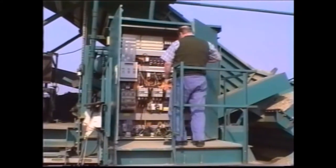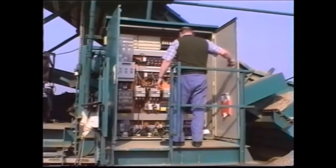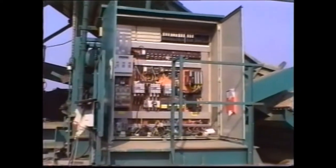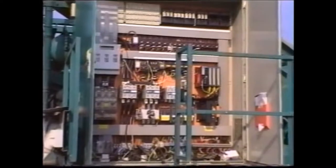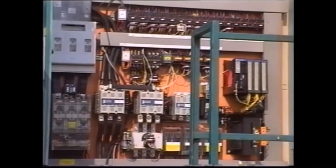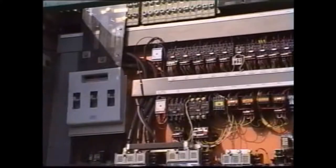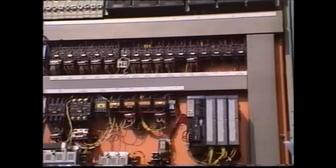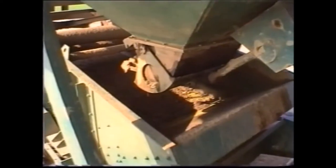The entire electrical installations of the plant are housed in this circuit cabinet. It also houses the modules for the so-called compact programmed control unit. This principle enables various operations to be controlled from the cab via this electronic system working at 24 volts. The grizzly, the feeder motor, and the dewatering unit can be controlled from here, either manually or in automatic mode.